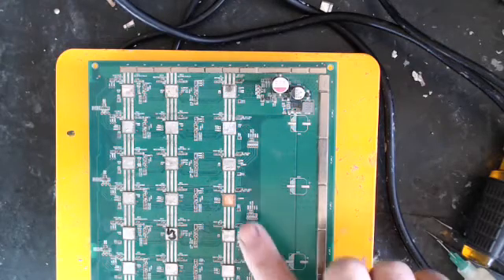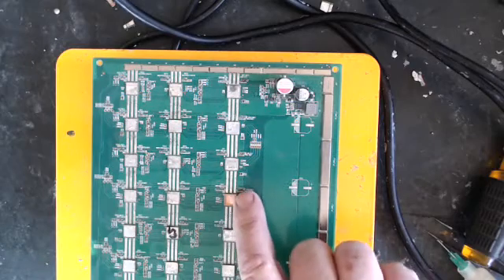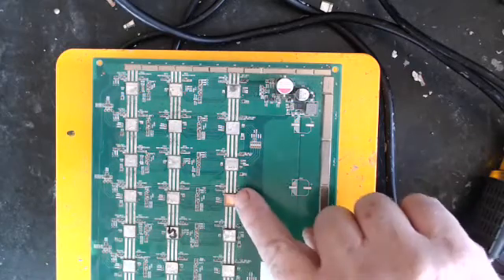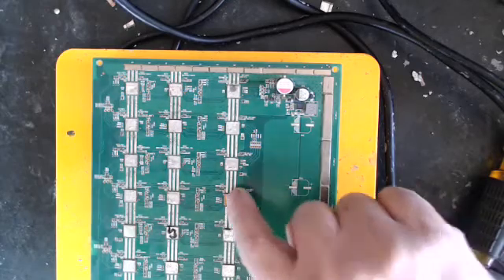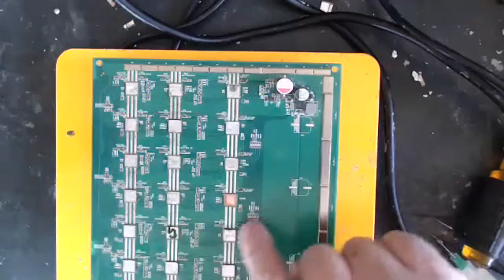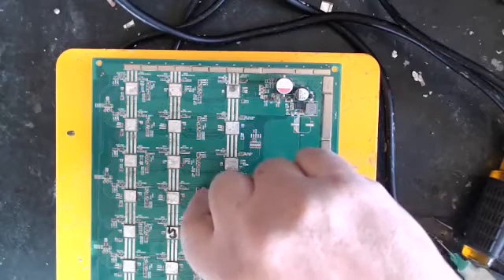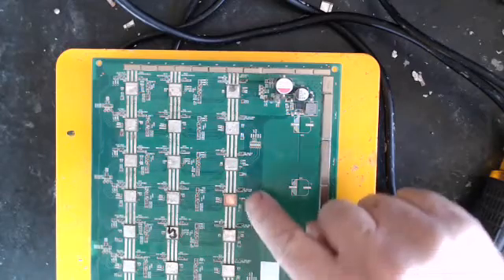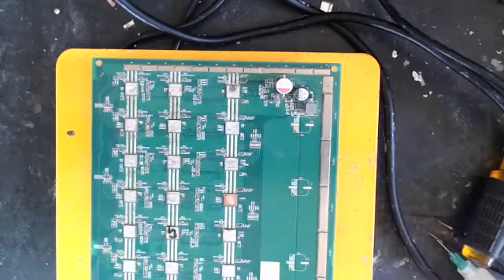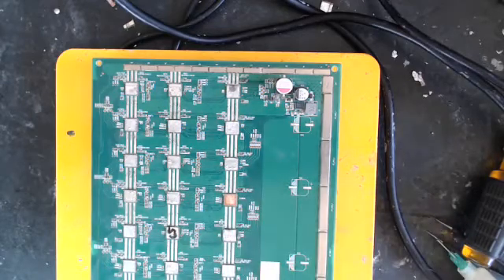I'm in the middle of a chip replacement. I soldered this with flux and a heat gun. I tested the resistance between here and the test points and I didn't like the resistance. Running through the test machine, I'm doing a lot better. With the old chip, you'd send 1.8 volts, it would get 0.3 and then put nothing out. Now I'm sending 1.8, it's getting 1.4, and then about 1.1. So I'm making a little better connection, but this chip is definitely not seated yet.